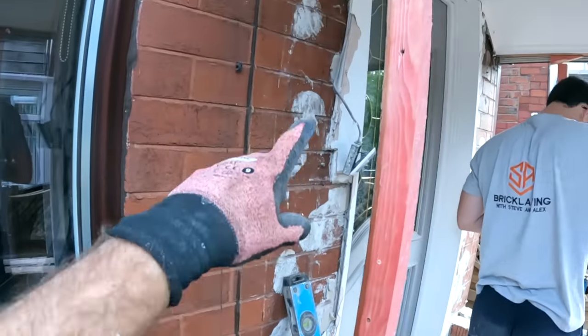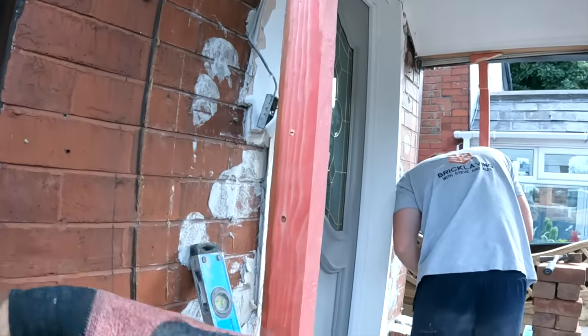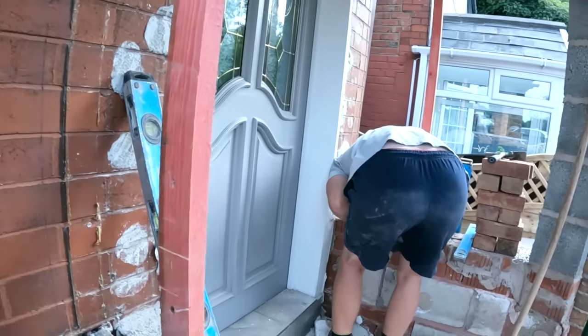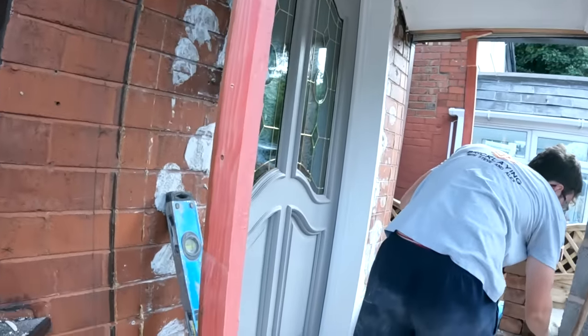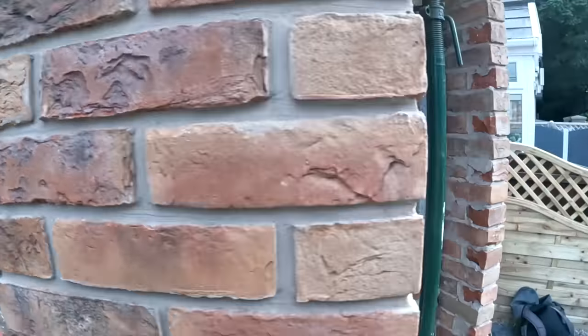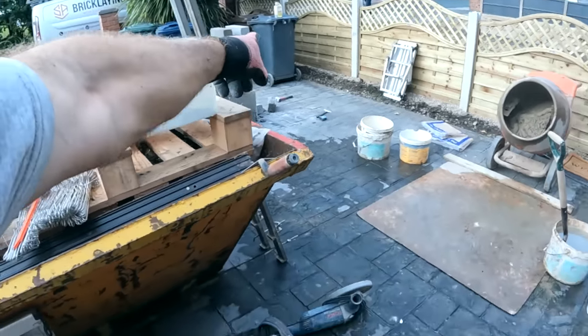Right, brew time. After a lot of fiddling about, we set up. These are our pillars, just a piece of batten, a wedge and a nail. So we just pull a line off that now. Rather than level and plumb, for a brick and a half with these bricks, that'd be a nightmare, so we just run them in. I think there's, how many courses, Al? 18 courses. 18 courses. And Alex has cut all his blocks for the back, all the 330mm pieces.